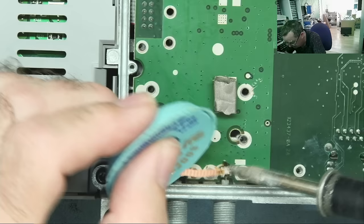Okay, so different schools of thought, really. You could just say change all the capacitors, you wouldn't be wrong. You could say change these three and then see if it's stable, you wouldn't be wrong. Different ways to work, and really it's down to what you feel like, maybe down to a bit of experience. So let's just clean these holes and replace these three, and now let's see whether the power supply is working